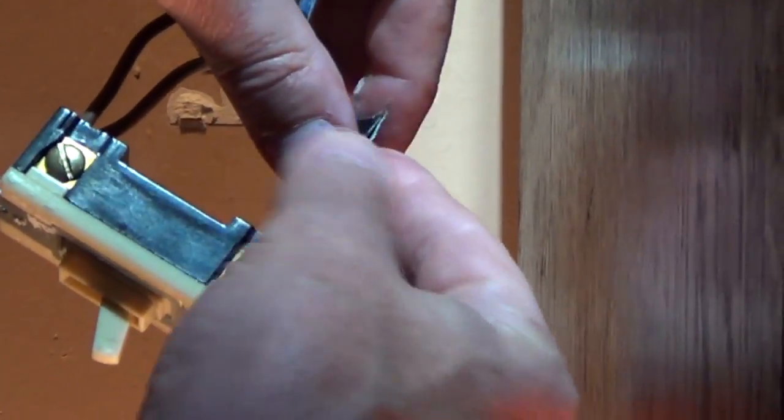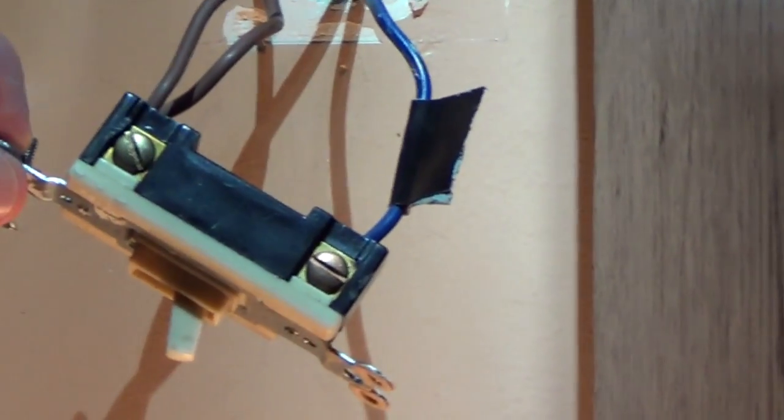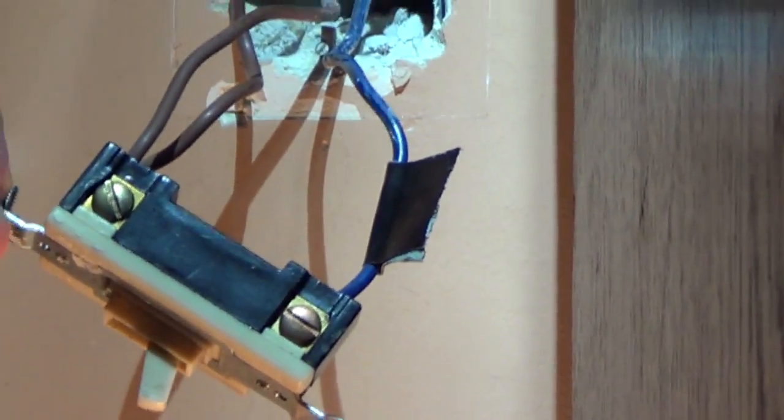In this case it's this blue wire. I'm going to take a piece of tape and mark this, so that when I unscrew everything, I know this is the wire that's going to be connected to the dark screw on the new three-way switch.